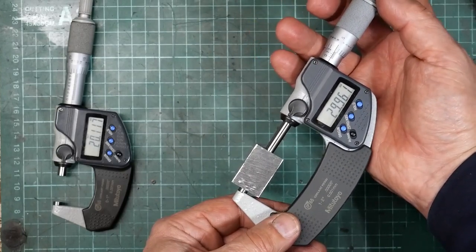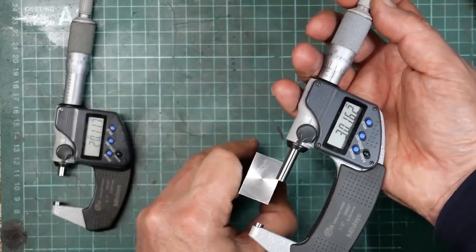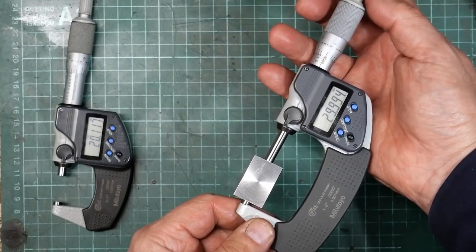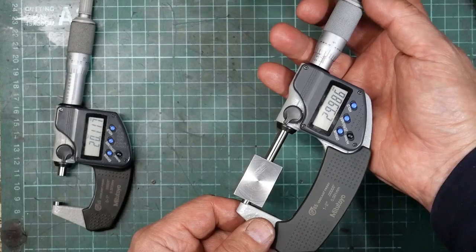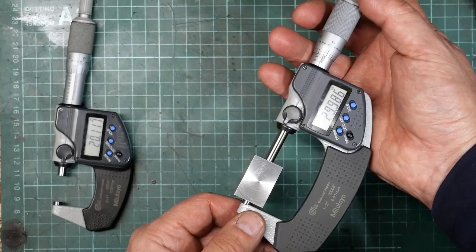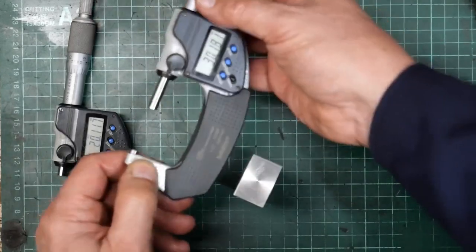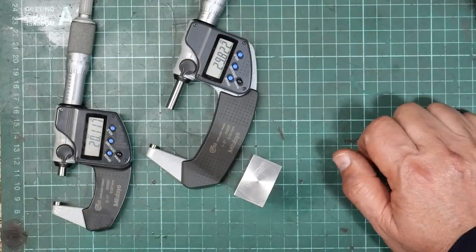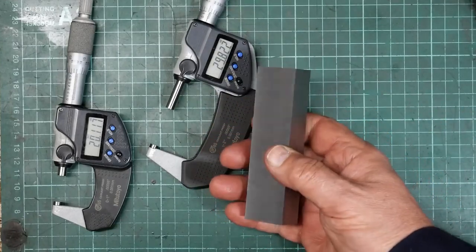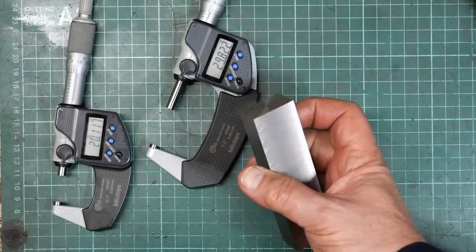I was shooting for 30 there, I've got 29.96. Probably a bit closer size wise here, but I still didn't. I suppose that's pretty close to 30. I'm getting a bit used to the lathe though, where I can hit the marks a bit more easily. Anyway, the external dimensions of this piece are a bit nominal, so that's certainly going to be close enough. Press on.